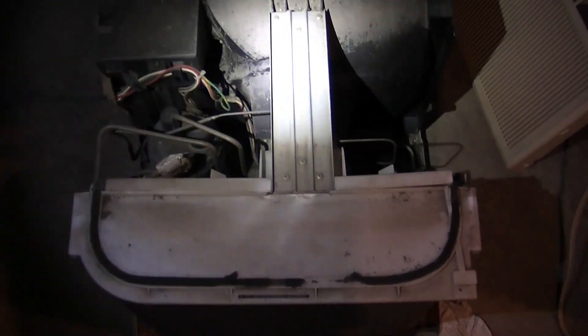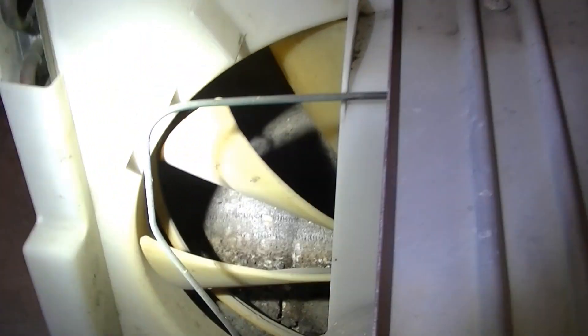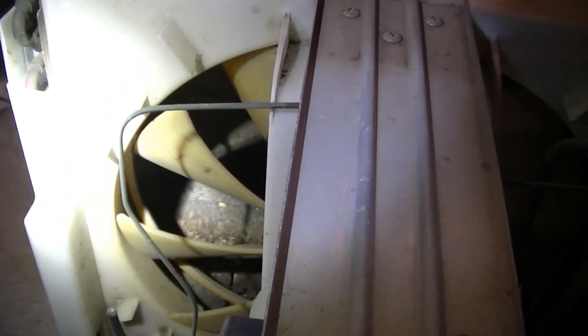There's our compressor and there's our Samsung fan motor. This one is from 1995 — the date code on the motor looks like October 15th, 1995. That condenser coil is actually a little bent. I don't know how people treat these so poorly — it just amazes me. But it still works fine, so I'm going to clean this and then oil it. That coil is pretty dusty looking, so that'll need to be cleaned big time.